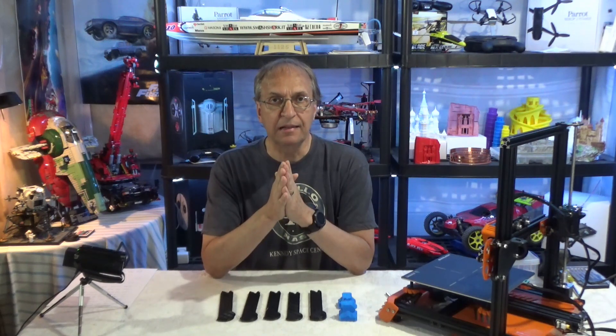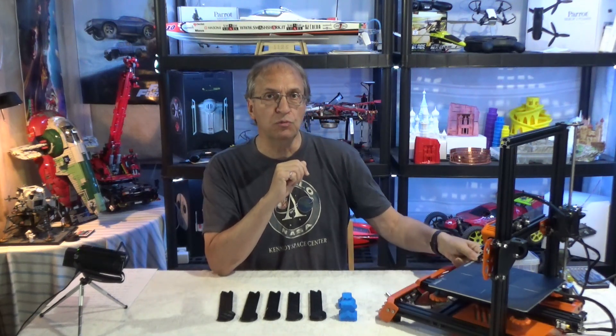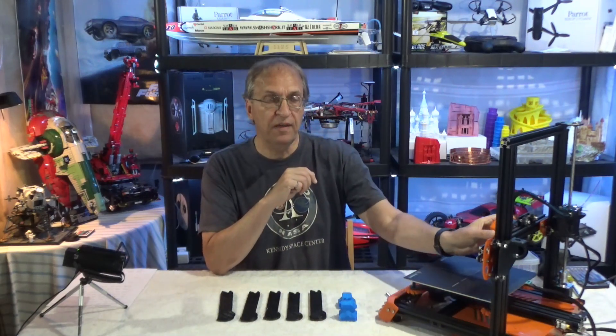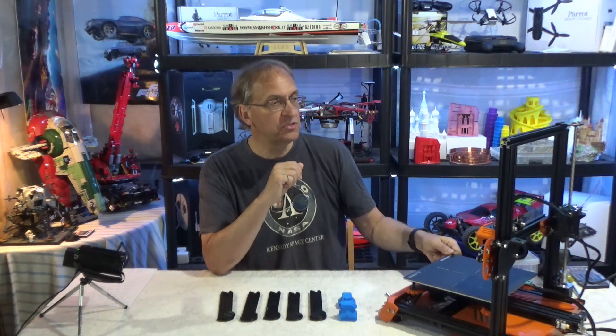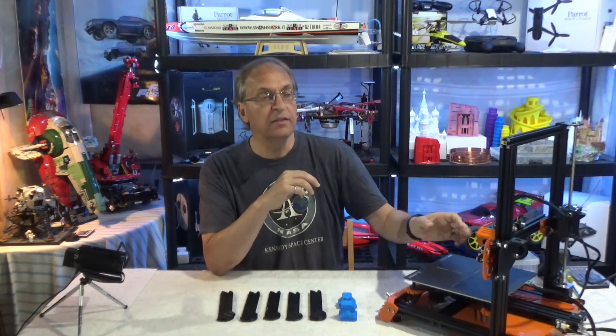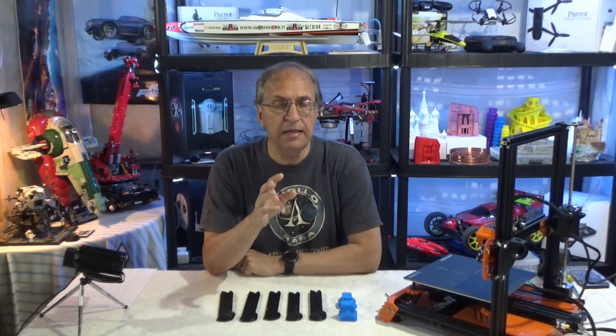First thing mechanically, you have to make sure your printer is mechanically sound. When you install it, and if you look at my assembly video, everything needs to move smoothly — no wiggling on the Y axis especially, smooth X axis also. Adjust your eccentric nuts well, not too tight and not loose. The Z axis — before you install the Z rod, you have to move it up and down like I showed in my assembly video. Make sure your printer is good mechanically.